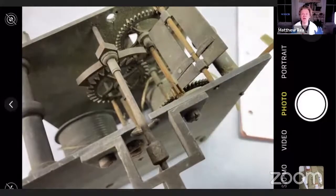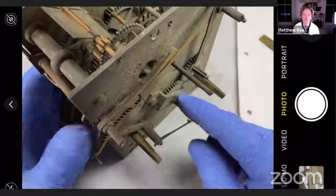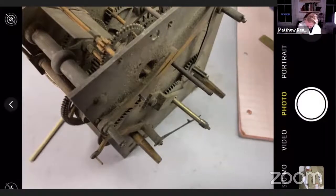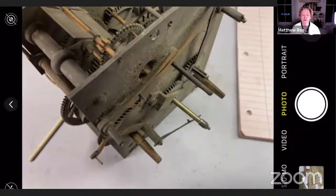So we've got some repairs that are really good fun, like the fly spring, and they'll be quite easy and we can be quite creative. We've got some other repairs that are quite controversial, like the bushing. And then we've got other repairs that are slightly more tricky, like this hour wheel pipe that you have to have done. So they would go into our report to our client normally, and we'd say it's X hours, Y hours, and Z hours, and that's going to cost you so much. I haven't got the crutch loop on there. We may come across other things when we get the clock apart.